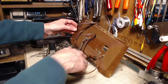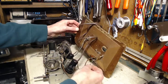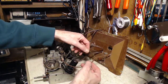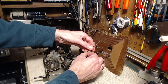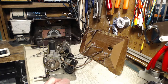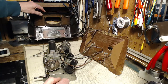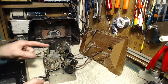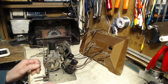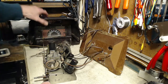One connection here and one there — that's probably what it should be. One's just twisted, so we've had somebody who doesn't really know how radios work basically twisting together the loose wires on a guess — a bad guess on the speaker and a bad guess on the antenna. But probably no harm to the radio. Why is the light sitting inside the radio like this? It's normally expected to be right towards the front. I'm not sure if that's its original installation location.